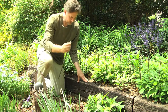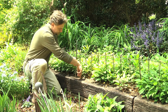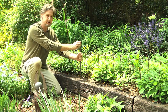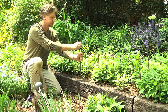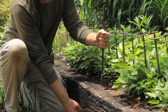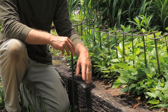You would want to drill in the thicker part of the timber — some of these timbers have little holes in them. Drill the hole not on the edge but in the center. Then go back into that hole and take a small sledgehammer — not a regular hammer, as that will take too long — and start hammering this spike all the way through until it is flush with the top of the timber. That way, if you put another landscape timber on top, it's flush.